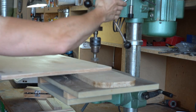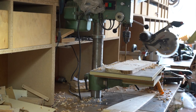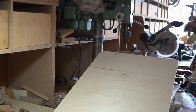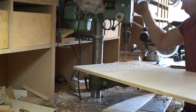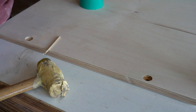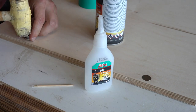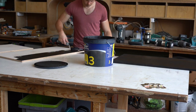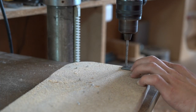I pulled one more sheet of plywood and started building the doors and inner shelves for the unit. I could have — and should have — done it beforehand, but as I mentioned I wasn't decided on the full design yet, so I'm doing it now. Making two doors wasn't an option simply because the doors would have been too wide and the hinges wouldn't have held. So I had to create an insert in the middle and I decided to make it removable, held by magnets. Once the insert was done I painted everything black just to match the looks.